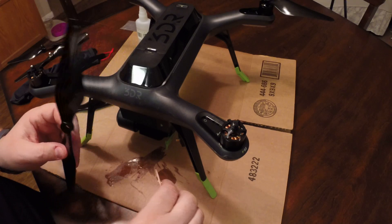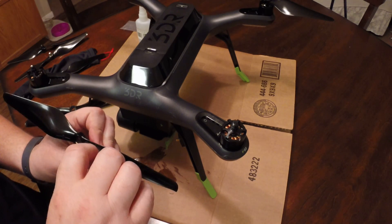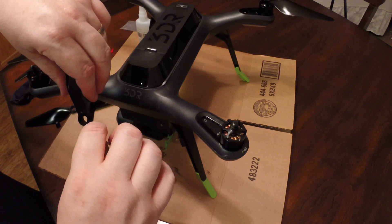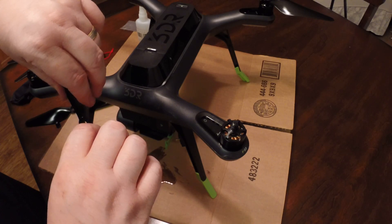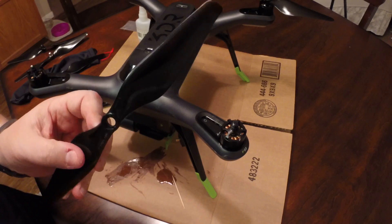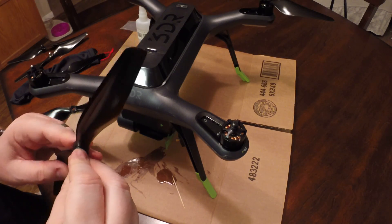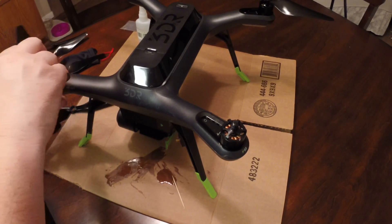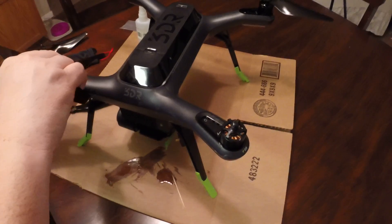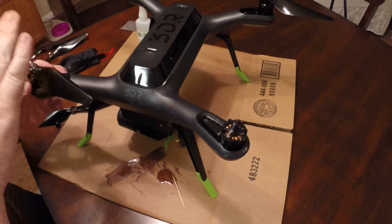Just dab it on the inside of two or three of the flat edges of that hex. Do not put it on the circle side, and only use a little bit like this — if you don't have a toothpick, use something super small. You don't want that much. Then that nut slides right in there, and once you tighten it down on your motor all the way, it's a little bit of friction to get it down, but once it seats you can tell because it won't go anymore — then just stop.